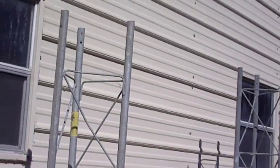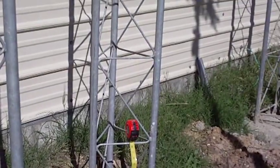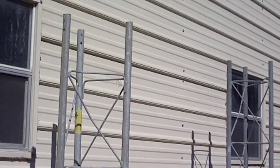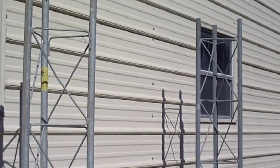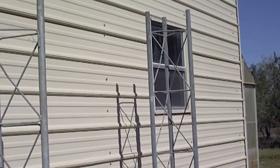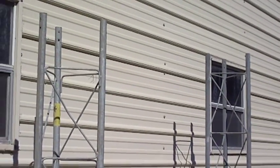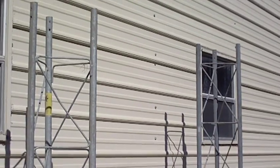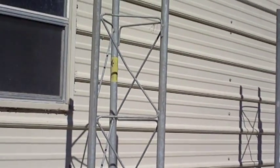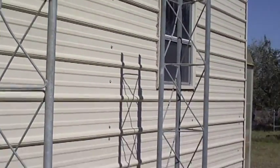That's what's going on right now. Sometime this week I'll pour the cement — hopefully it'll be done by this weekend. If it is and I have the time, I'll go ahead and rent a man lift and begin assembling the towers, then put the turbines on top. One tower is going to be 35 feet, the other one is going to be 30 feet — that's enough to clear my trees all around me and give me plenty of power without worrying about wind loads. That's the home of the Windmax one-kilowatt turbines.